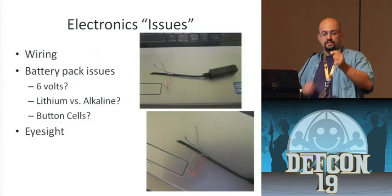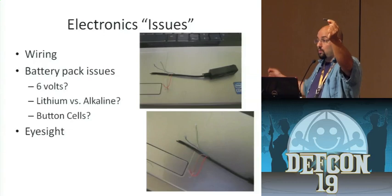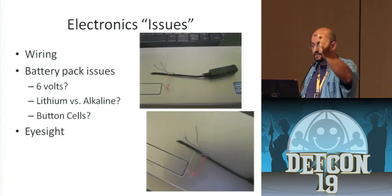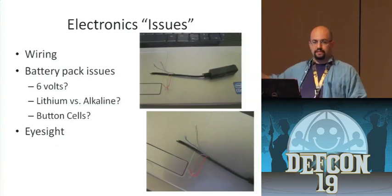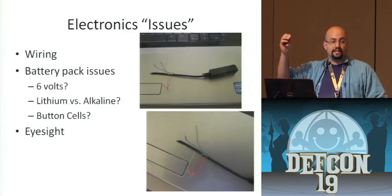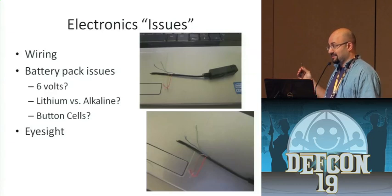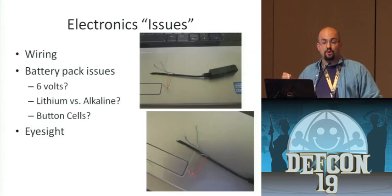Then wire it. Because you see this connector? The connector for getting the battery or the wall wart hooked up to it took up too much space. So I cut the cord because, you know, it's DC. Two wires, right? No, four. By the way, if you get the wrong polarity, you blow the camera. That's an expensive trial and error. So we had some problems.